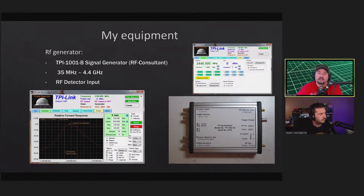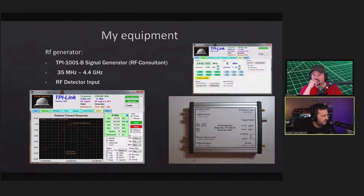Ape: When I built the 'Shorty 40' — an end-fed half-wave for 40 meters that's only 40 feet long using an induction coil — I needed to measure the coil's inductance to confirm the right frequency response to cut off 20 meters. Using a signal input and measuring output through the filter, I could see the sweep on a chart and make small adjustments — take turns off or add turns to the coil — to tune the filter to the right frequency.